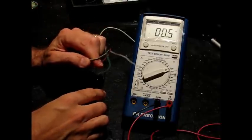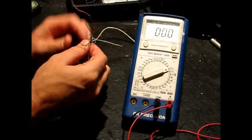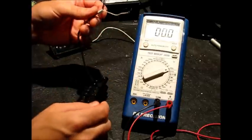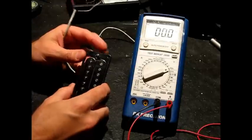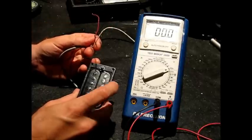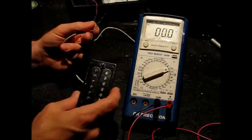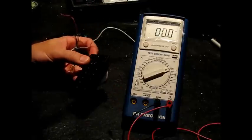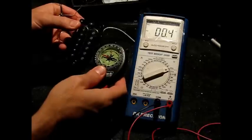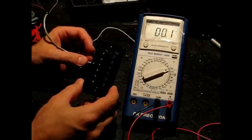Just in summary: make sure you check every wire against every other wire. Check first with DC resistance to figure out which wires are connected to which coils and make sure there are no shorts between wires and the ground wire. Then go to a small voltage scale, get a steel or iron metal object, and determine which coil is connected to which wires and what the polarity is. If it's important for your application — if you're going to be connecting single coils together — bring in your magnet and figure out which coils are north and which are south. Thanks for watching.